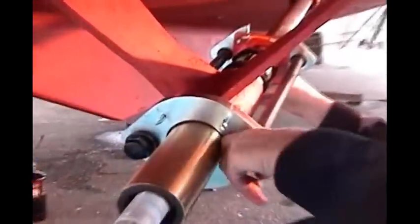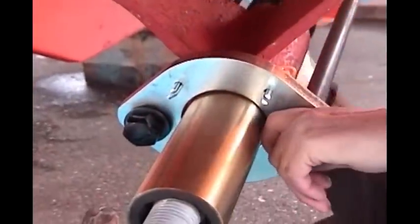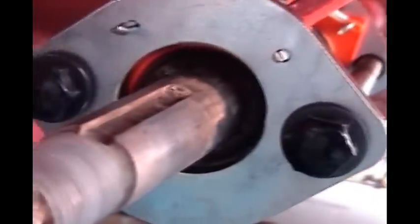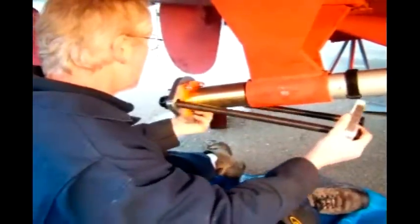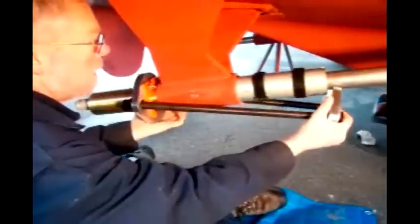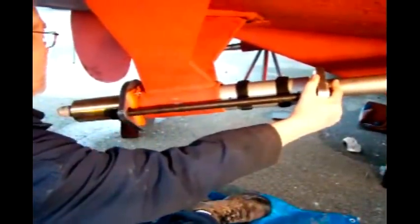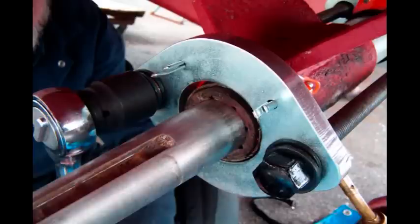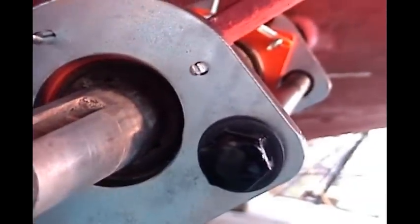It is very important to apply equal pressure to both threaded rods. Begin by hand-turning the welded nuts clockwise — this will compress the puller assembly. Tap the horseshoe up out of the way of the old bearing. Here is a tip: if you have your new bearing, slide it onto the propeller shaft up to the aft end of the strut. Rest the aft horseshoe on the new bearing to automatically align itself and prevent the old bearing from making contact with the aft horseshoe during removal. There must be clearance for the cutlass bearing to slide out through the aft horseshoe.